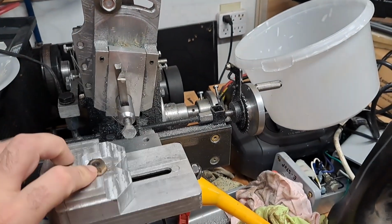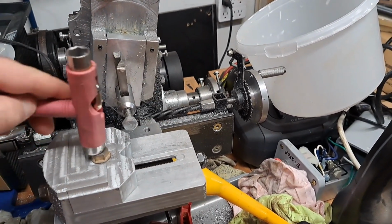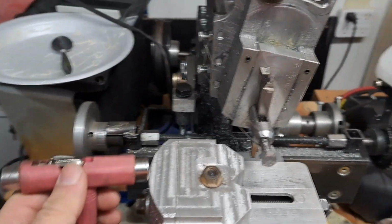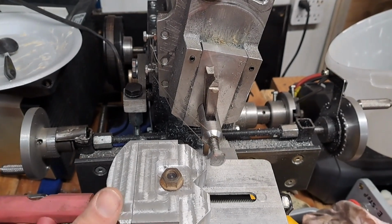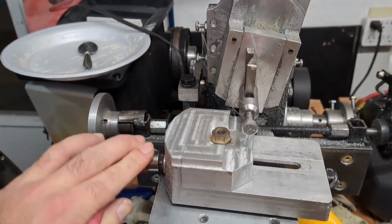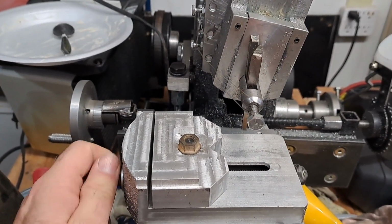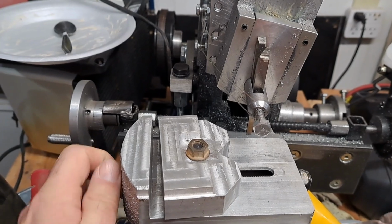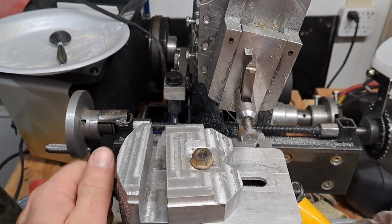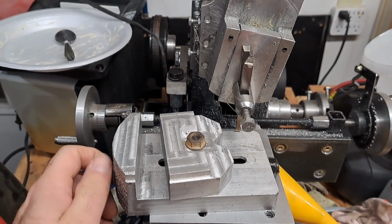Yeah. So there you could take, loosen the top bolt. Still got to build the base for it. Unloosen it from the side here. Oh, that's tightening. Hard to hold the camera and show you. There. Now she's unlocked. Vice jaw moves. What's nice about this is you pull in first and you lock down that bolt on top of the jaw, and she locks it down with no jaw lift, which is what I wanted.